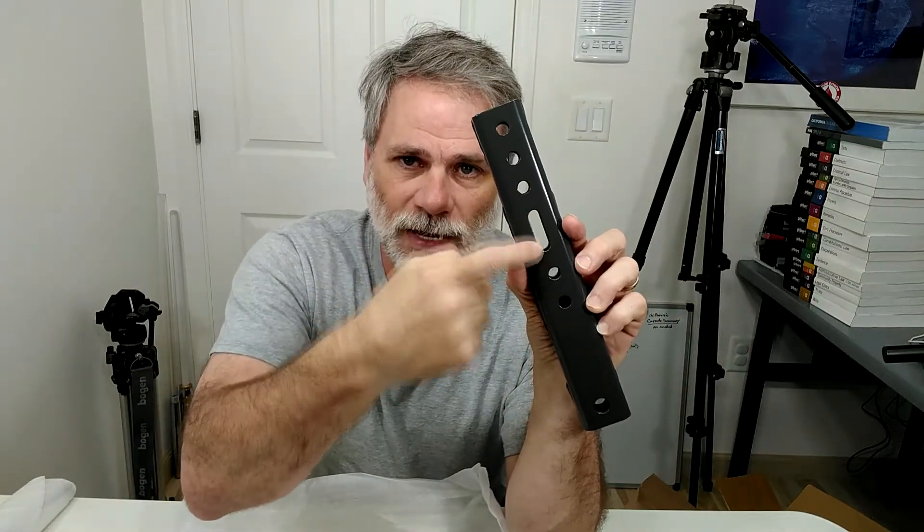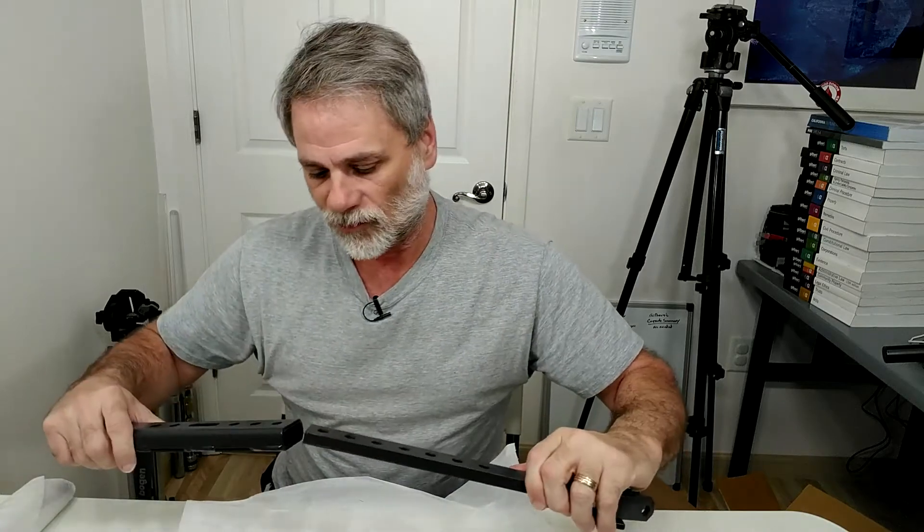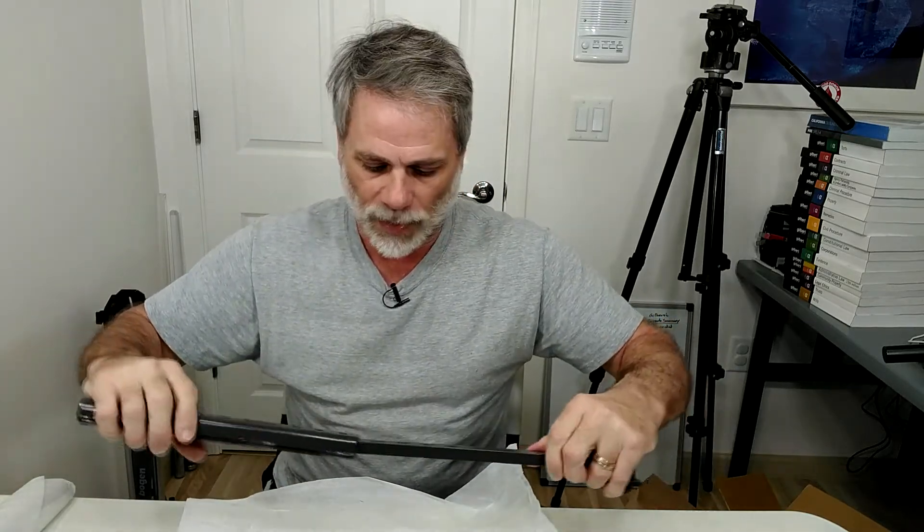There's a set of single holes and then an elongated hole here. The other gentleman who makes these things — Hodge, that's his name, you can look up Hodge stabilizers — he still makes them. The main difference with this elongated hole is that if you put your bolt through it, it can slide back and forth and give you a little bit of play in your implement. That's why I purchased this specific Kubota part through their dealer network. My understanding is that the curved side goes up towards the sky.